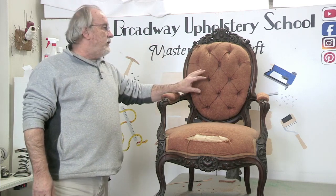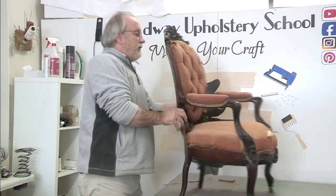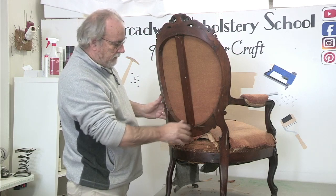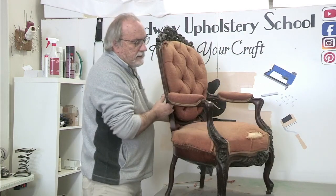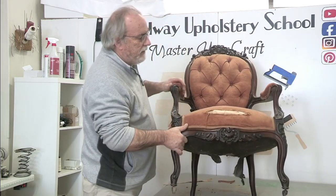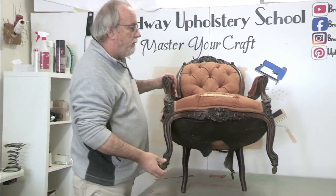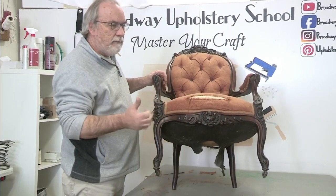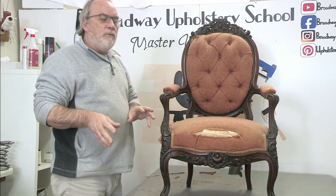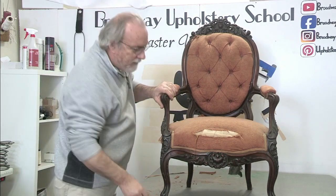It's the seat and the back that's going to be the issue. The back's got to come off. The inside back is recessed, which is also an indication of the age when you see this — usually an older treatment. The other thing that tells me about the age: I haven't identified the country of origin yet, but hopefully when I take this apart I'll see something. It's the wooden casters. So already it's definitely 1850 and before. I'm thinking more like 1820 English, English Victorian right now.